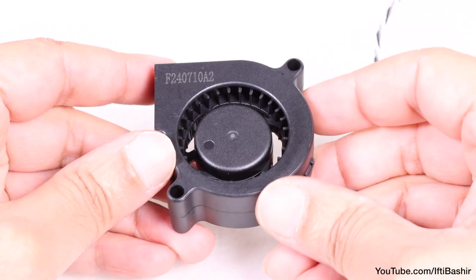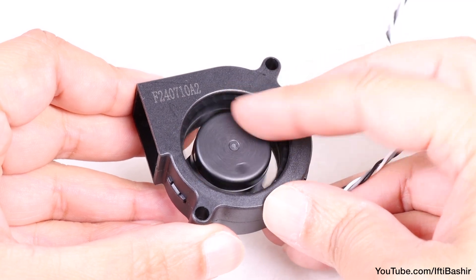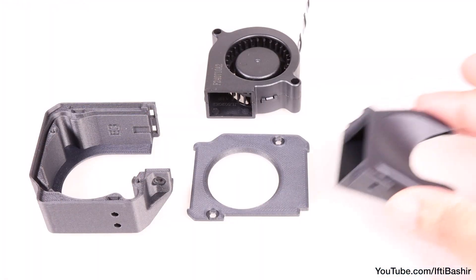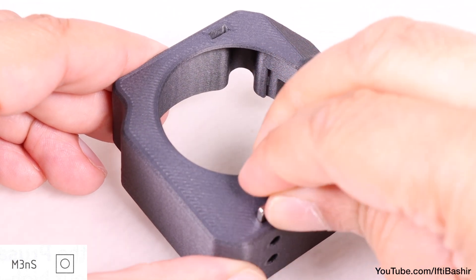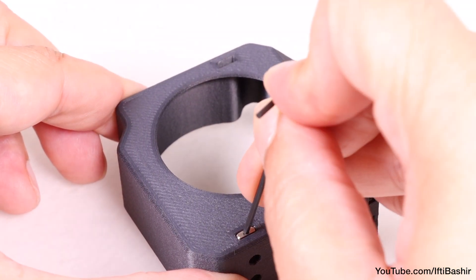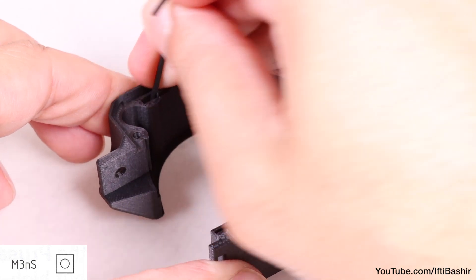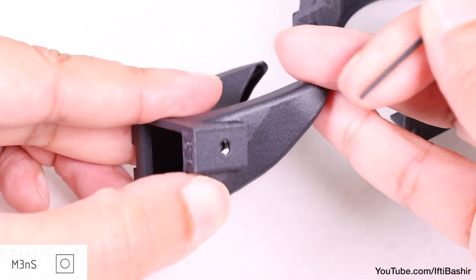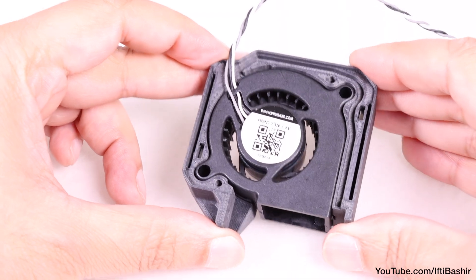Next is the new part blower fan — a high turbine-style fan efficient enough to operate at only 70 percent speed most of the time, making it quieter and ramping up as needed. We need the new shroud and fan case cover, all new parts for the MK4S. Starting with the main fan case, insert two M3 square nuts into the two available slots on the flat side, aligning each nut with the holes on the sides. Insert a further two M3 square nuts into the opposite side, plus one more into the fan shroud, aligning with the adjacent hole. Insert the fan into the fan case with the label facing upwards — it'll only fit one way.